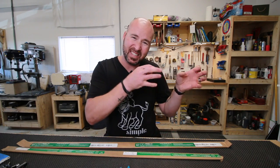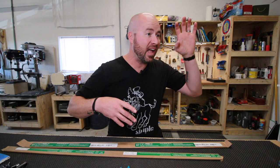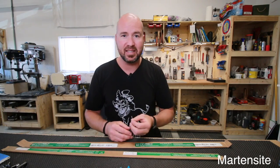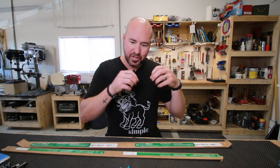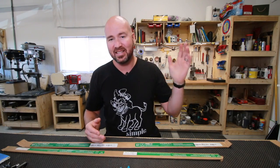That's what keeps it hard and sharp. So what we want to do is really quickly cool that. And essentially, we're kind of locking those in position, kind of like a game of freeze tag. So that's kind of what we're doing when we're cooling it down. And that's called the martensite state. It's a rapid cooling from austenite to get a hard crystal structure where the carbides are separated and locked in place. Essentially, that is the hardening process.